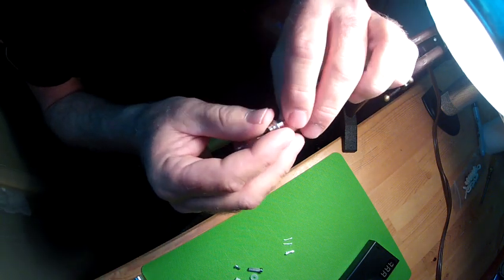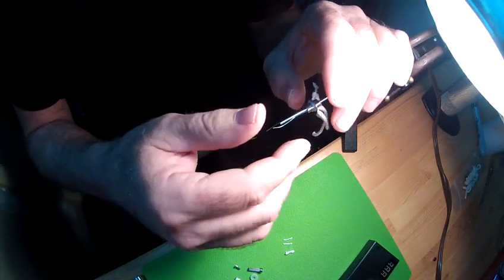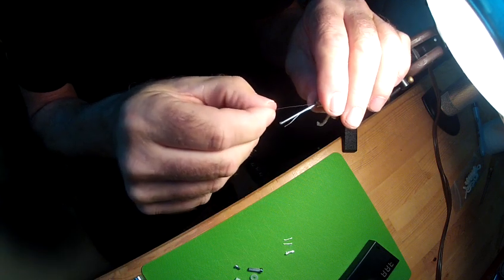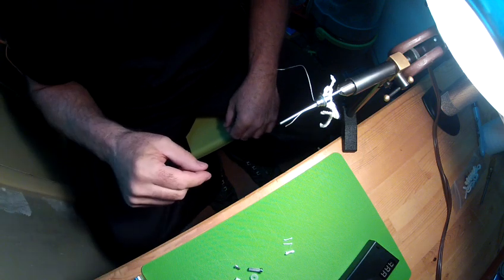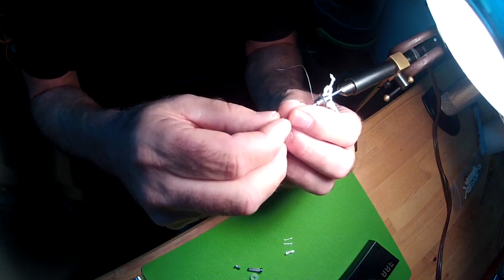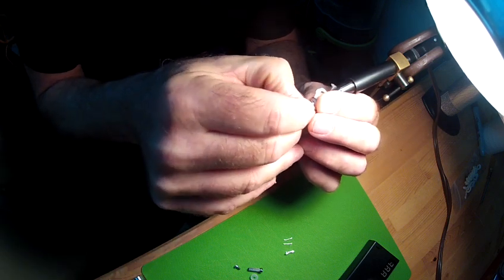Now you thread the cup on, and it's going to drop right in on those nubs that you made. Now, don't over-tighten here, but it'll lay itself right where it needs to be. You'll feel it, and put a little twist there. You are ready on this baby to go back together. Bring the insulator in and slide it right over that positive wire. So the beauty of this build, again, is that you're working on the mandrel. Things are able to stay centered.